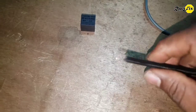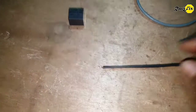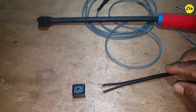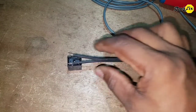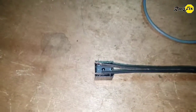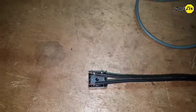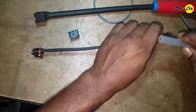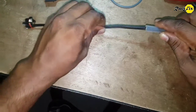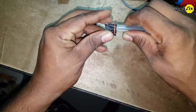I used a 2-wire hard telephone cable because it brings hardness and good flexibility to the handle during use. Simply solder the 2 wires onto the 2 pins on the relay. Then pour some epoxy to cover the soldered connection. Next, use a transparent tube to cover the wires, and solder the 2-coil telephone cable at the other end.